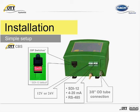The compact bubble sensor supports SDI-12 extended commands to enter local gravitational acceleration and local water temperature. While the compact bubble sensor is not difficult to set up, programming loggers can be a bit more tricky, especially if you have multiple sensors connected. To assist with programming these units, first think about the time it takes for all connected sensors to the data logger to complete a measurement. For example, if you have a multi-parameter sonde, a precipitation gauge, and a compact bubble sensor connected,